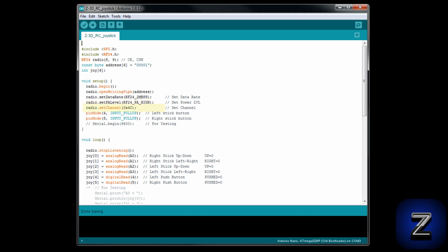Next, we are setting the radio's channel. The RF24 library has an example sketch included called Scanner. You can use this to scan all the radio channels and find one that is not being used and then enter its hex value here. In the description below, there will be a link to a video for tips and tricks for the NRF24L01 that will cover how to find a good channel to use by using the scanner sketch.